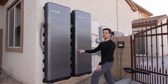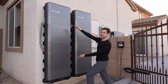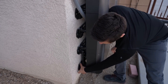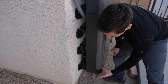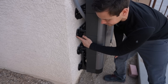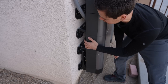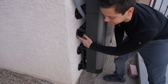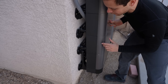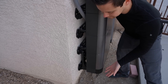This is a high-voltage battery — the entire stack runs at 240 volts DC for efficiency. The batteries are heavy, so you use large brackets. The first bracket connects to a shelf, and then you stack the batteries on top of that shelf. Mounting the brackets can be quite difficult. It does come with a template, but many installers prefer to mount the battery and bracket, mark the position, remove the battery, mount the bracket, then put the battery back on.